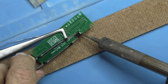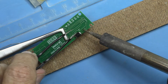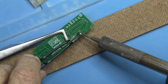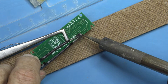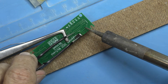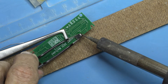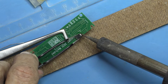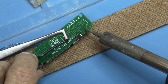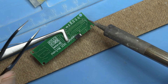Now I'm going to do it wrong for you and really heat that TVS up. That's good right there — it's solid. But if I stick around too long, it heats the TVS up too much, and what's going to happen is that's still molten solder in there — it's not solid. So if you stick around too long with your soldering iron, it's going to cause a problem. That should be solid now — yep, that's good.